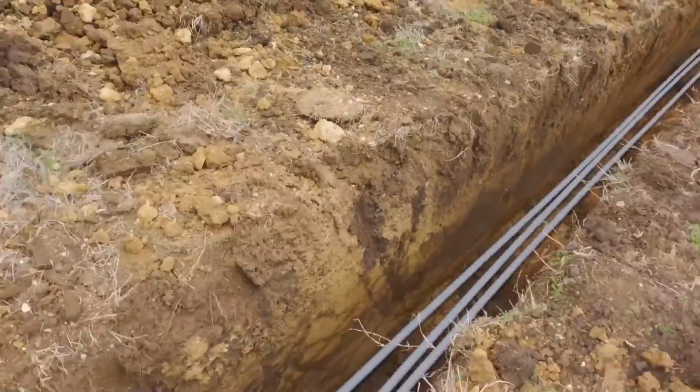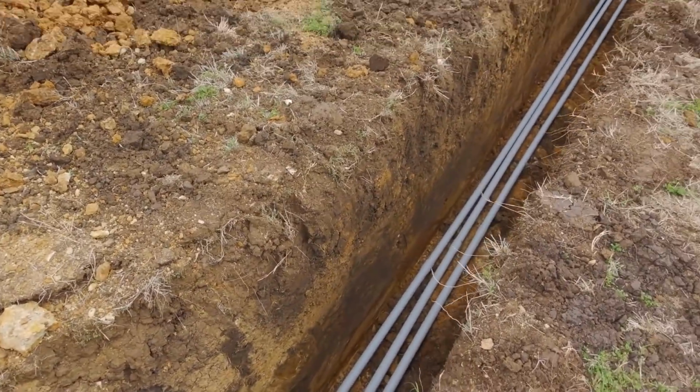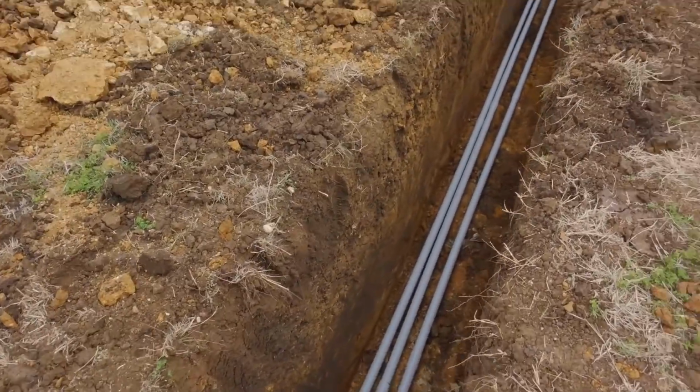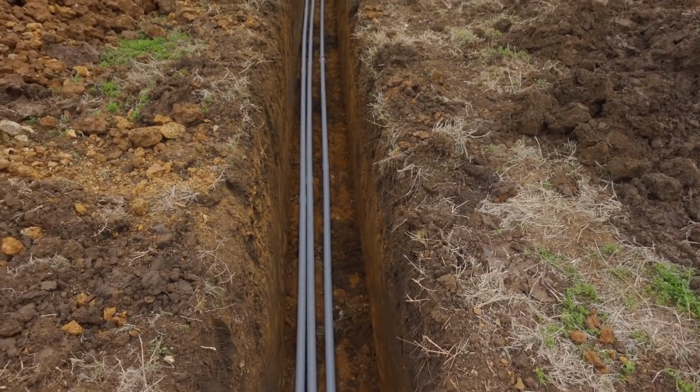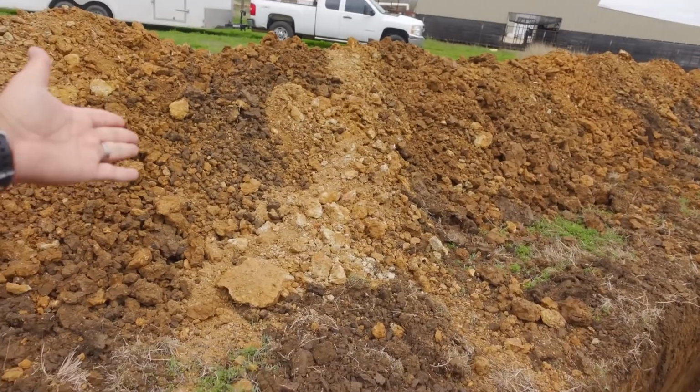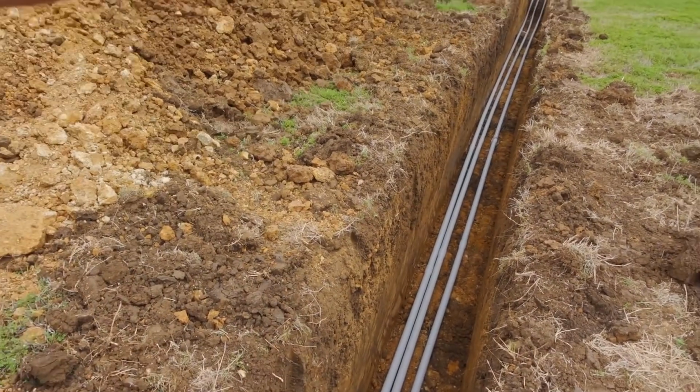The inspector came by. We had one come by yesterday, and we had another one come by today. They looked at the ditch, the mesh for the ditch. They asked for 5 feet deep. So this ditch needed to be 5 feet deep from the surface. I gave them close to 6 feet because, number one, I thought it was gonna rain, and I was afraid some of this dirt was gonna wash in there and fill up part of the ditch. So we gave it extra depth.